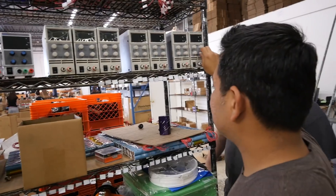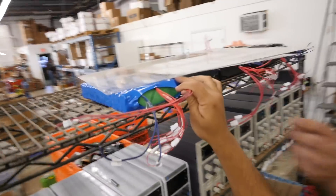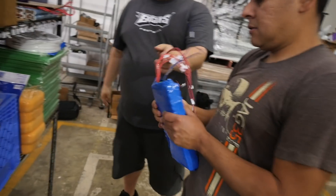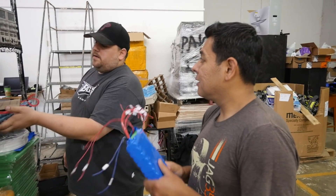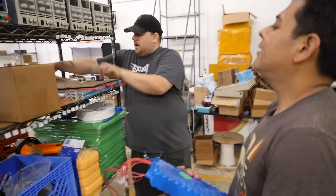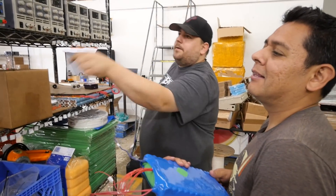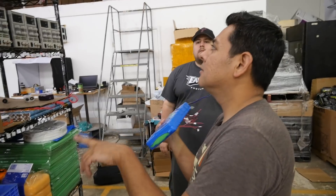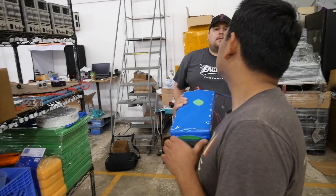Here's a pack we built — see the green and black one on the top left? That's a 48-volt 14S pack with all the wire leads, positives and negatives. We want to start pumping these out, especially with the next load coming in — it's going to be a lot of these. The cells come in already in 2S4P modules, so they line up and we solder them. Corey specializes in soldering — you can't even tell if a machine did it or if it was him. Turns out Tom also has a boat, and we're out on the Delaware River.